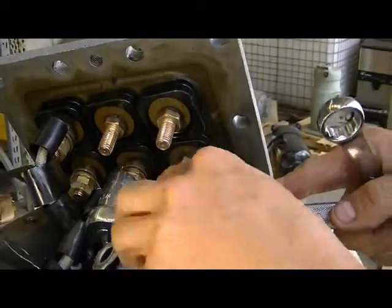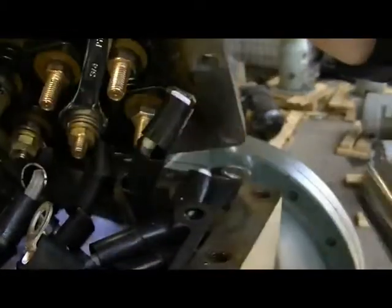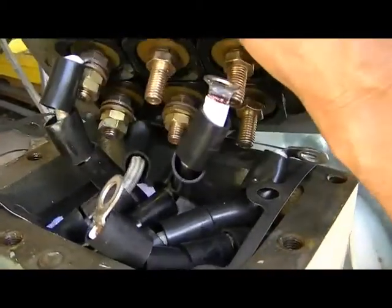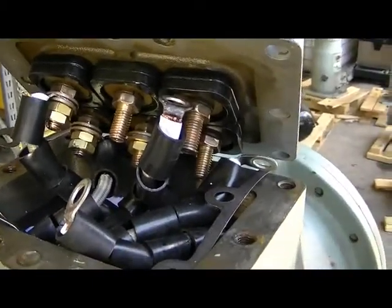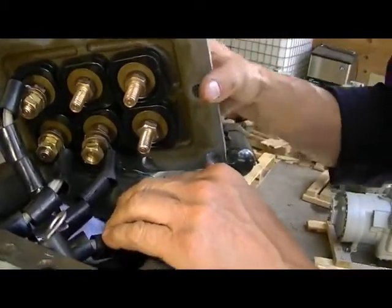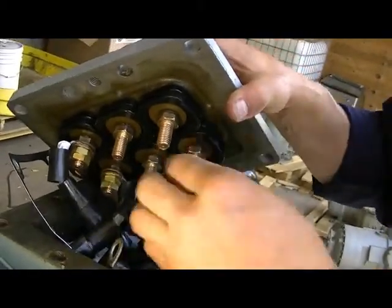This brings up another good point: if you're tightening the lugs from the top, these things will spin on the bottom. And if they spin, these wires spin around with them. You may feel like you're tightening something when you're actually spinning these inside the motor terminal block, inside the compressor. They'll turn until they break. If you try to tighten from the top, the whole thing spins and you'll keep spinning that wire until it snaps. So if you have a leaking terminal, tightening it from the top is a poor choice. And why we have these rags in here — if one of these drops down in there, you will never get it out. They're brass.